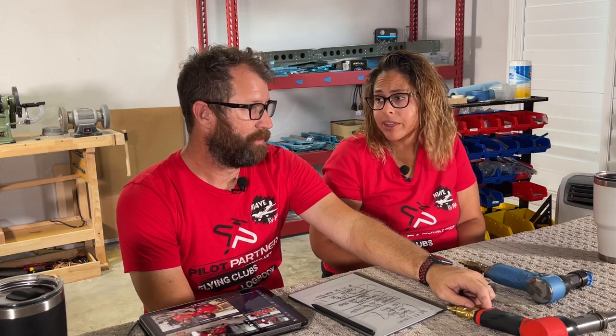That video went into details about work hardening on the rivets, and I was like, that's exactly what I'm seeing — except he's not seeing it but I'm seeing it because I'm holding the bucking bar. And I was like, that's it, we're getting a 3x rivet gun for these big rivets. It felt like we could hit it all day long and it wasn't going to go anywhere.